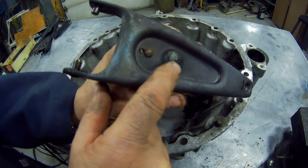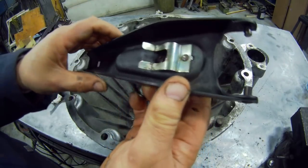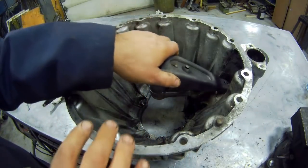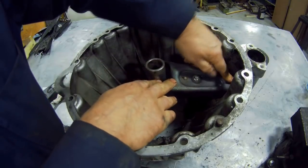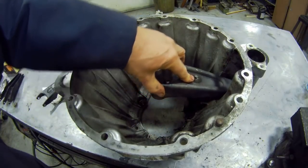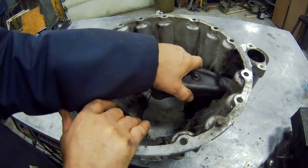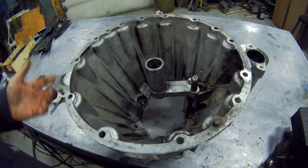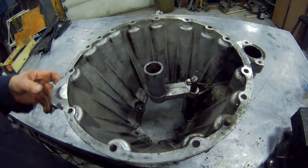You can see it's completely dry — no lubrication in it at all — and that's all because of that friction. You can see the ball popping through there, and with a bit more pressure it wouldn't take much to come through. If you get rid of the friction, you'll get rid of that problem. It's a bad design because you can't get in to lubricate it. If you could get in every now and again and put a dab of grease on it, that would be fine.